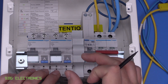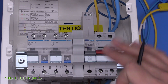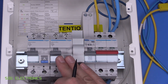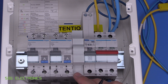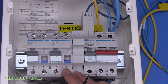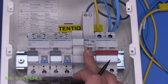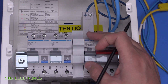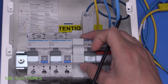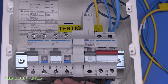The simplest devices seem to have just two bandpass filters and look at the difference between those entering some averaging summer. So there's actually no microcontroller in the simplest devices at all — it's all analog. You can imagine that's either going to be very sensitive to false tripping or it's just going to miss an arc fault event altogether. So what Hager have decided to do is put a microcontroller in here that can be reprogrammed over the Bluetooth link, which means if they find a better way of detecting arcs, they can update the firmware and you've got the latest protection rather than being left with devices that aren't that useful.